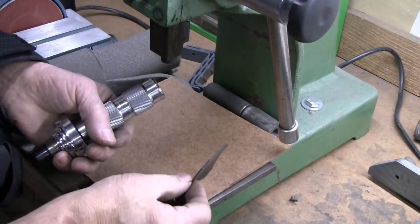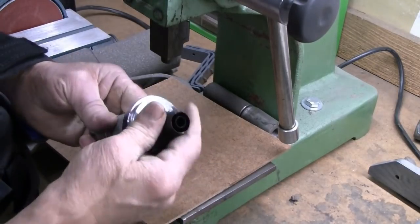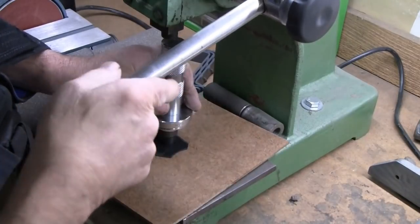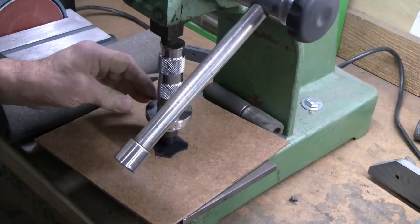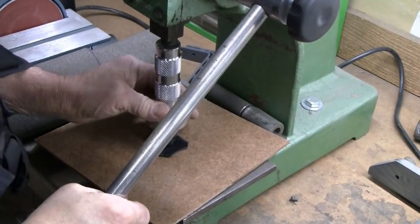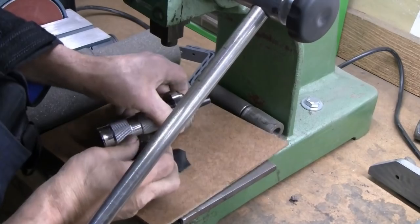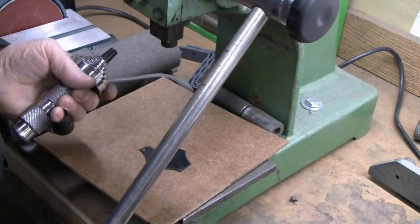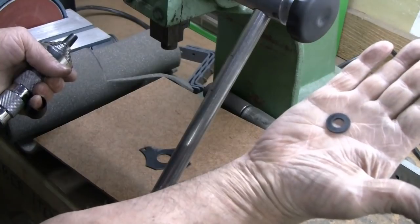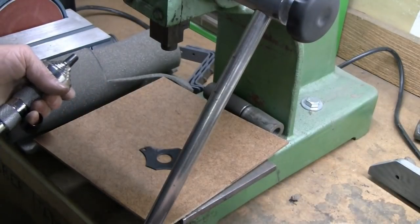I have a piece of 1/16th-inch thick EPDM rubber sheet here. Let's see if I can get a 3/8 by 3/4 gasket out of that using the arbor press. This is just a sheet of masonite as a sacrificial cutting surface. And there we go — there's a gasket. A very nice, very true, well-centered EPDM rubber gasket, 3/8 by 3/4. Just as simple as that. If you need a bunch of them, you can do these lickety-split — one, two, three.